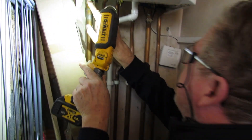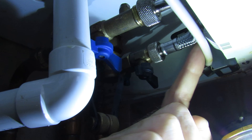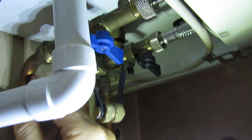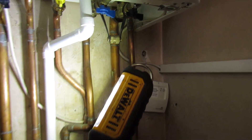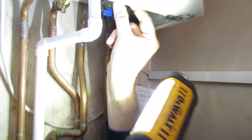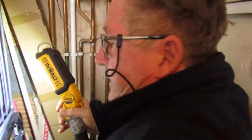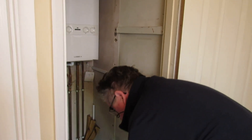We keep having to refill it with water. There's what I call a loop fill pipe — it's like a braided pipe. There's your cold water coming into the boiler inlet, and then it comes round and fills all your radiators up. So in a minute, with the boiler turned off, we'll be removing this with some mole grips and attaching a leak treatment to it.